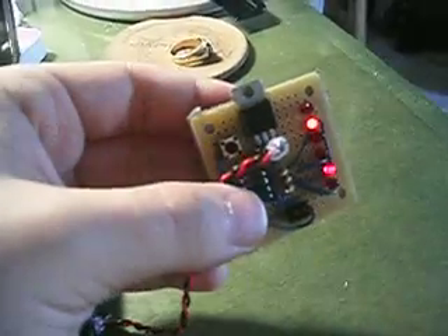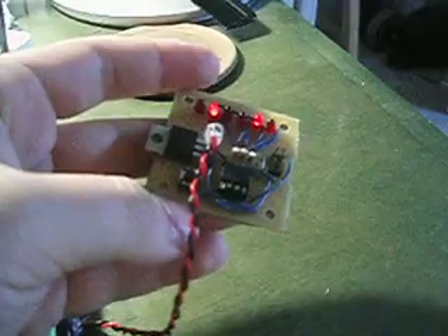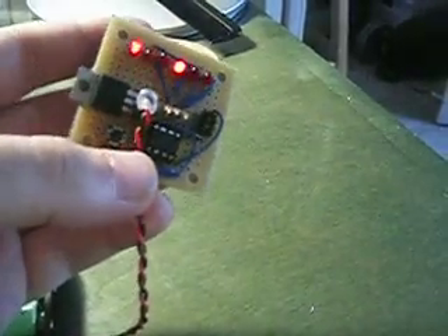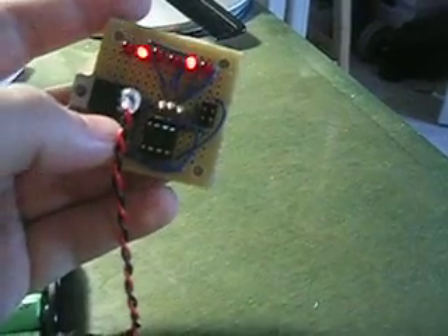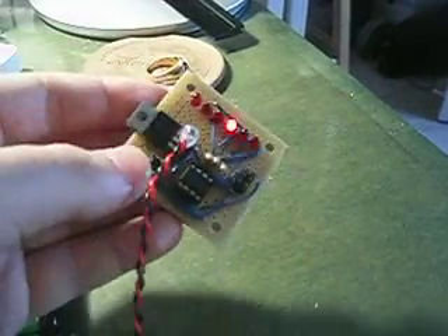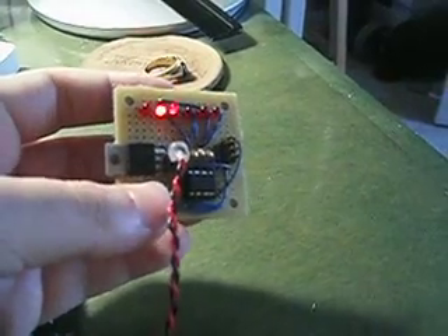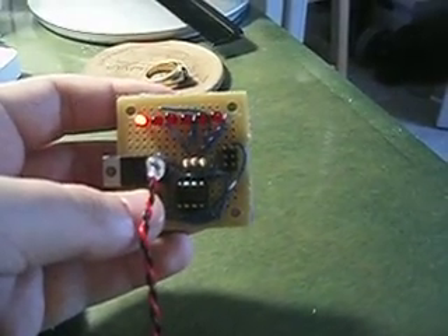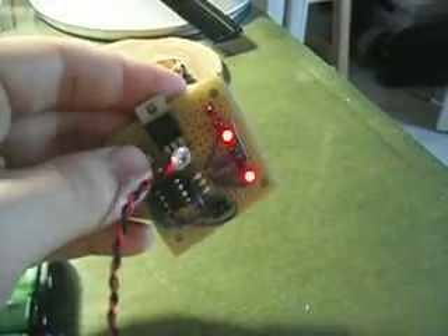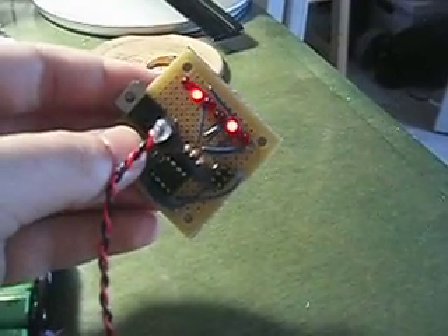This little switch here — rather than actually use up an input on a switch, I simply use some EEPROM to store the current state. When it turns on, it goes to the next state. So what you're actually doing when you hit the button is you reset it — you drop the reset pin to ground, which goes ahead and enables the pins with a switch in the code. You get a nice little multiple-state system using no inputs essentially for that switch.